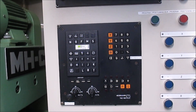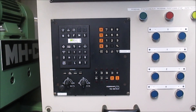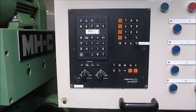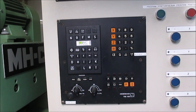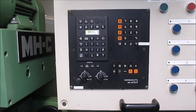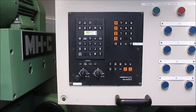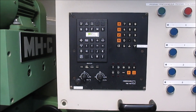So if you were to get one of these machines with a Philips controller, my suggestion would be to bite the bullet and look at the link I've given elsewhere, and upgrade the machine to Linux CNC — that seems to be the way to go. Keep all the servos that are correct for this machine rather than going to Mach 3, and then you'll have the ability to have a computer that you can continuously upgrade from now on. Linux CNC will grow with all the open source contributors working on it diligently.